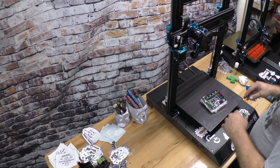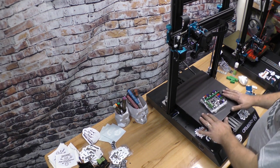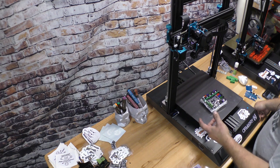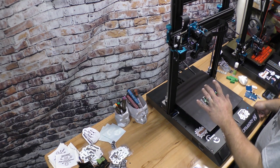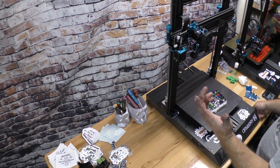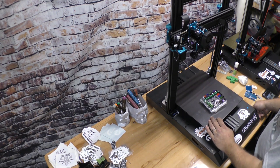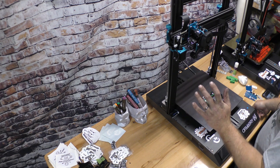I love these printers. This is just dumb luck what happened. When you mass produce parts, they go bad. So I was using the printer, plugged it in, went to run a part, and I came back maybe 5 minutes later. I normally come and check and make sure that it's gone through the first couple layers, the fans kicked on, everything's going good. And luckily I did, because it was stopped right after it started the first layer. And I looked down, and the thermistor was reading like 300 degrees when it should have been 200. So I canceled it. I noticed it kept running away to the point where it melted everything down. I unplugged it, changed the thermistor out, turned it back on, instantly ran away again. And that's where I started looking into it.